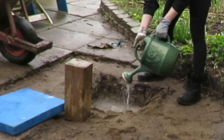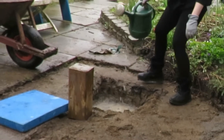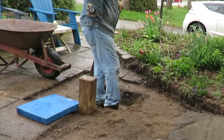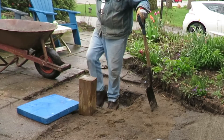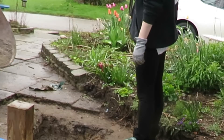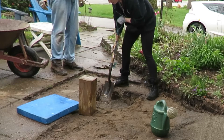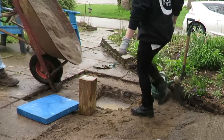Sometimes it's easier to drill a couple of things in here, but it's better when it's taller because then it's heavier and you have to tamp it down. What will happen is over the course of the first year, this will turn pretty much to concrete because there's limestone in there.